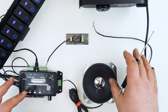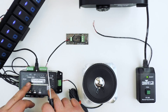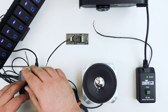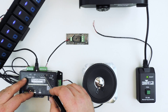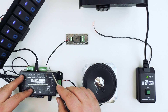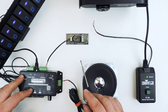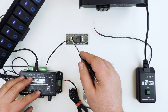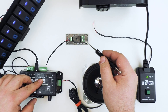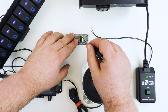Now we're going to take a look at how to control a fog machine as we did earlier, but this time with a controller that has solid state outputs. In this example, we're going to be looking at an escape keeper. Solid state outputs are outputs that actually send power out of them. In this case, we have 12-volt power coming into our controller, and there's 12-volt power coming out of our output. We don't want to put that 12-volt power directly into the remote for the fog machine — that would damage it. So what we've done is installed a relay in between the solid state output of the controller and our input for the button on the fog machine. This is a 12-volt relay, so it's going to activate when it receives the 12 volts sent by the output on the controller. Just like the relays on the peekaboo, it's just going to touch C to NO. So all we need to do is take the two wires from our fog machine remote and plug them into C and NO on our relay.